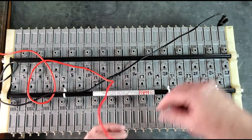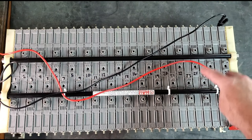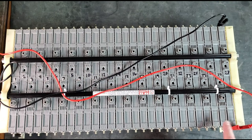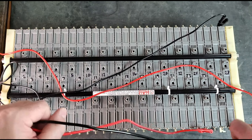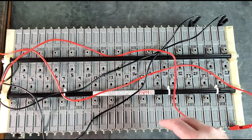I put the black on negative and the red on positive. Now these are done in series, so every other one is going to be another positive, and in between are the negatives. You don't want to do two cells that are right next to each other because you want to try to spread the heat out a little bit. So what I like to do is skip and go to the next one down. I'll know I didn't miss any because I can check on my piece of paper.